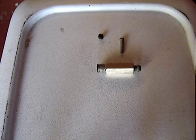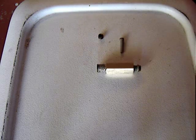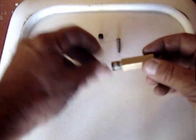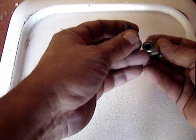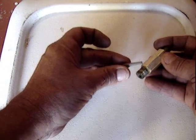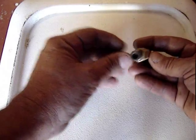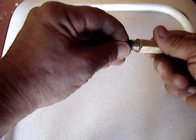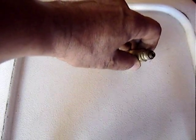The main body of the flashback arrester you're going to have to buy, borrow, beg or steal — something like this. This is brass, this is a good unit. This came out of a welding apparatus and it's got an integral bronze sintered filter that fits in the back here and is secured in place with a hollow nut which is screwed into the body.